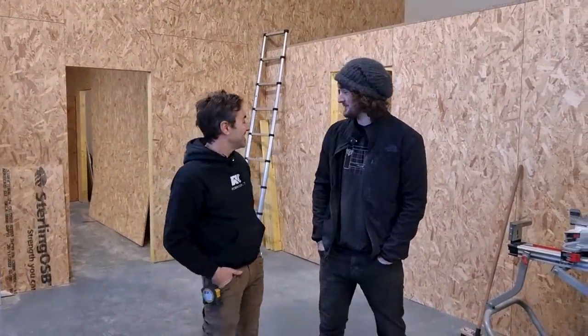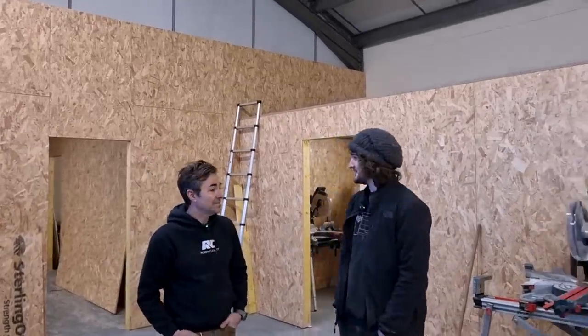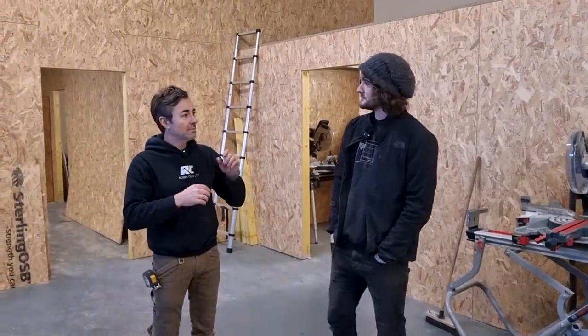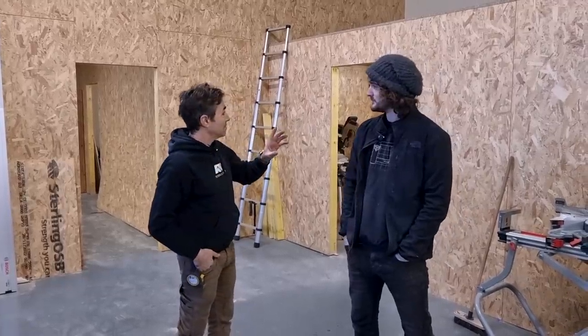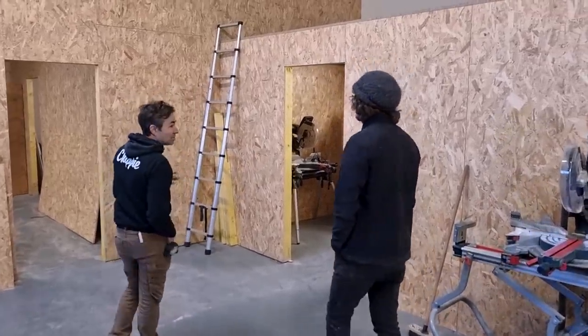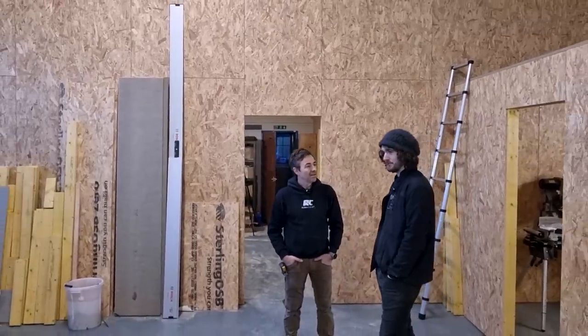We're done, mate. I can't believe it — two and a half days for this is mental. It was good fun. I mean, I've got my top team here, so it's just a matter of getting stuck into it. Because we had the time to think about it — we met here, talked it through, and I was able to go away and work out what we needed in the way of materials. We were so lucky to have the metric OSB because that saves so much time. You're building everything through at 400 or 600 centres, and if you've then got to start cutting rips off the sides of OSB it's an absolute nightmare. So it's really nice to look out for metric OSB — most timber merchants can get it but a lot of people just haven't got a clue about it.